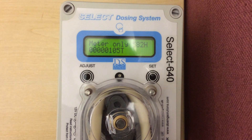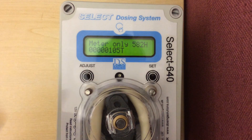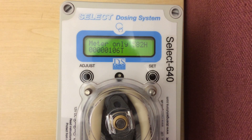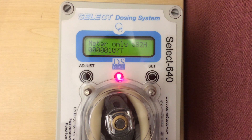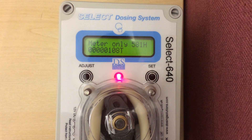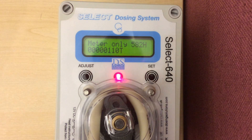How do we record the water? If you look at the front screen at the minute, it says meter only, and passing through the system is the water flowing at 582 litres an hour. This is generated by a pulse generator. The bottom left hand corner of the screen is saying at the moment 108, just gone to 109. That is how many litres has passed through the machine since I last reset it.